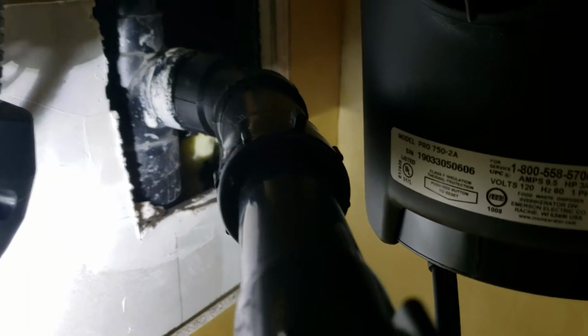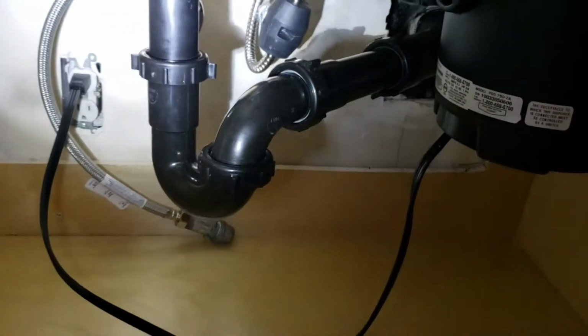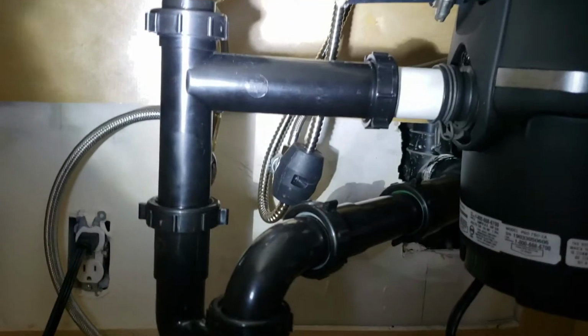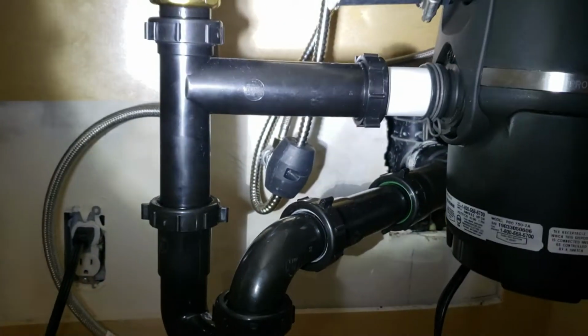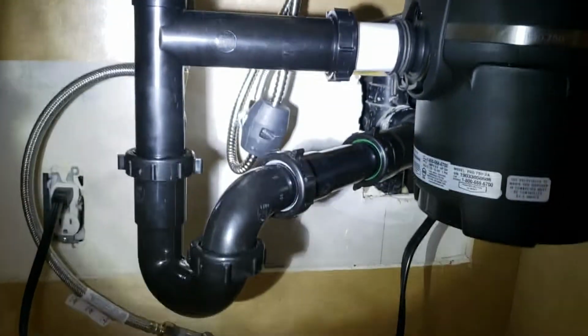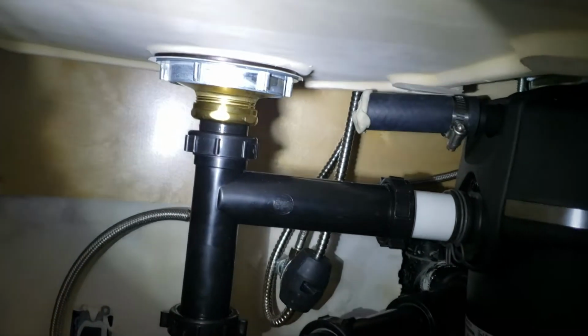But so the fittings that were in, we had to cut them out, and there was no pipe to tie into. And so what we have back there, in the very back, you can see the sanitary tee in the wall that's kind of discolored with paint on it. We had to take a ram bit and drill out the plastic out of that fitting, because we needed to reuse it. And then, of course, a brand new 1.5 inch schedule 40, and then a piece of pipe, and then transition over to tubular, and then we got a P-trap sitting in here, and then over to the tailpiece. That's a telescoping kit that we installed as well. Trap and telescoping kit, we either get those at Ferguson or Home Depot. Anybody can find those. But tubular plastic, up to a little tiny tailpiece. Brass nut comes with the basket strainer, and so that's good.